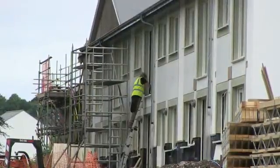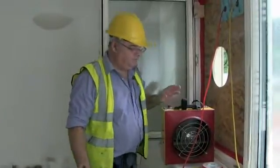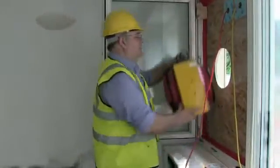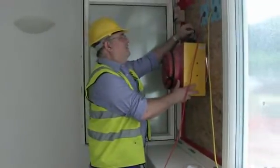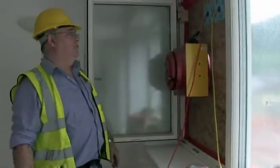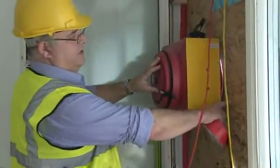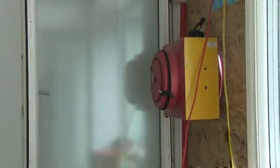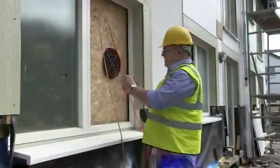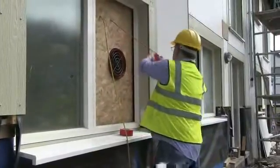What's still true is that the basic fabric is working well. This is a small calibrated fan — it's made in the States. We like the small fans because otherwise we find we can't get low enough pressures to do proper testing. The UK standard and the Passive House Institute set a maximum of 100 pascals because of concern about damage to plasterboard and the like. We've hung it on a screw and I'm going outside to tape it up to get a good seal. This red tube is where we measure the pressure difference from inside to outside, which is one of the key variables in the test, the other being the airflow — the amount of air we are blowing through the fan.